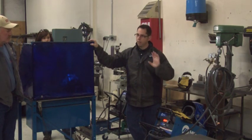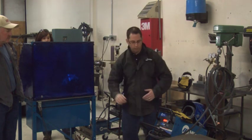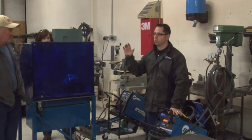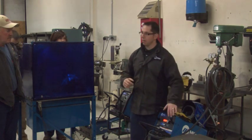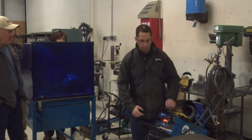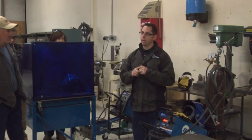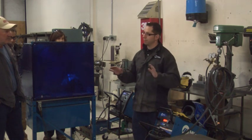We tried to take some cost out, keep it simple, and just stick with the TIG side. How many of you guys know, if you had eighth-inch aluminum, what you would set that machine for? That's the common thing we run into. If you take a look at a lot of machines in the past, you almost have to have a pilot's license to run the machine with all the different knobs and gauges on the front. Here, you only need to know two simple things: what material type you're working on and its thickness, and you can set this machine and start welding right off the bat.